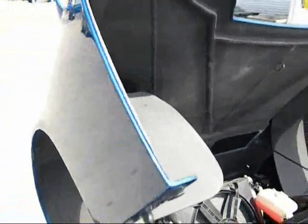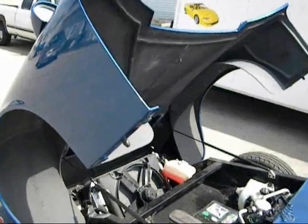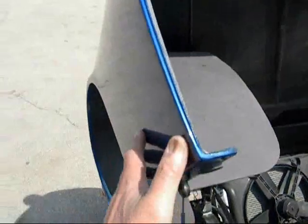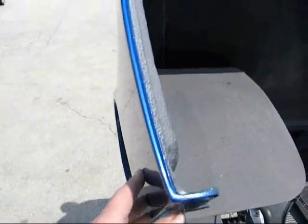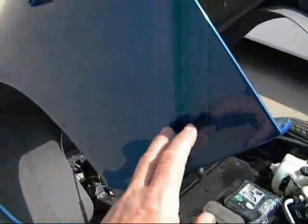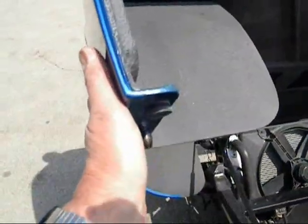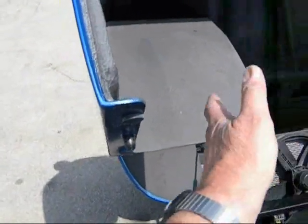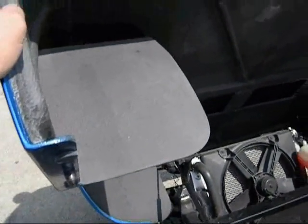The car had memory, if you will. While the car was sitting around while we were in the process of building it and building the chassis and stuff, the body was moving around. The fiberglass quality was from the 60s, what used to be made in the 60s in the U.S. And like this, I call this a sideburn, this area here. The sideburns and front and rear clip both moved in, the memory in the fiberglass had this thing moved in about 6-8 inches, and the body didn't come with any instructions or any clue how to put it together.